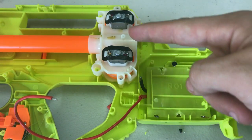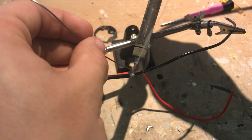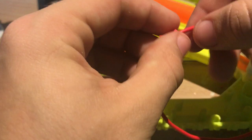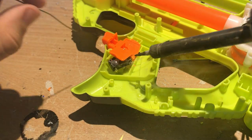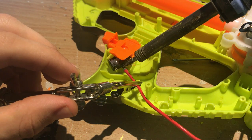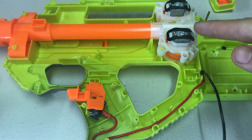Let's run our negative wire for our motors now to save time wiring back to a connector later. Repeat the same steps as previously done. Now let's solder on the positive lead to the NO tab on our micro switch. Tin the wire and switch tab, then reheat the solder once in position. Our final wire comes from the C tab and runs through our motors' positive connectors.